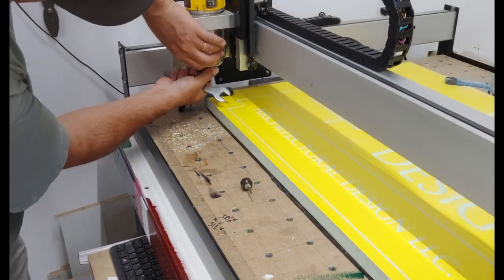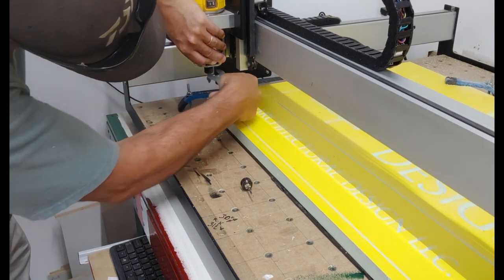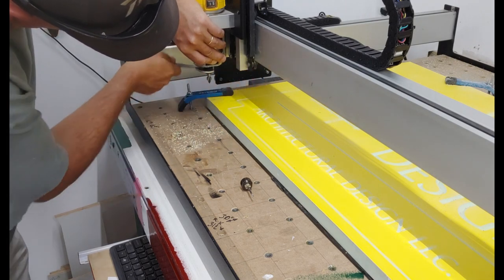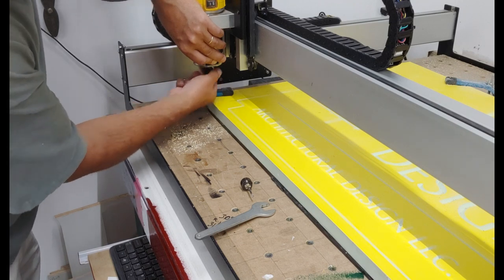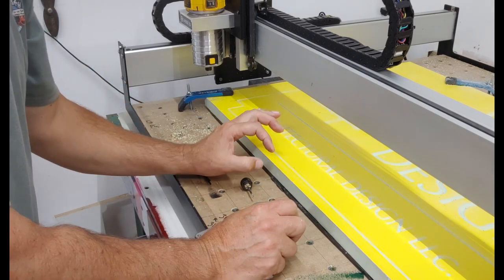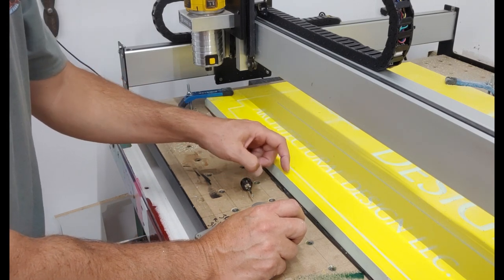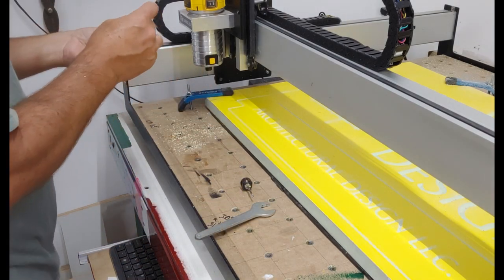All right, guys, so now we've got a bit change. We're going from the V-carve to the 1/8 inch end mill. The reason it's an 1/8 inch is because I was afraid if I did a quarter, since I only allowed a half inch overage for my substrate width. So hopefully with the eighth inch, it won't eat out. It'll still have something to grab hold of, and it won't break loose of the substrate.